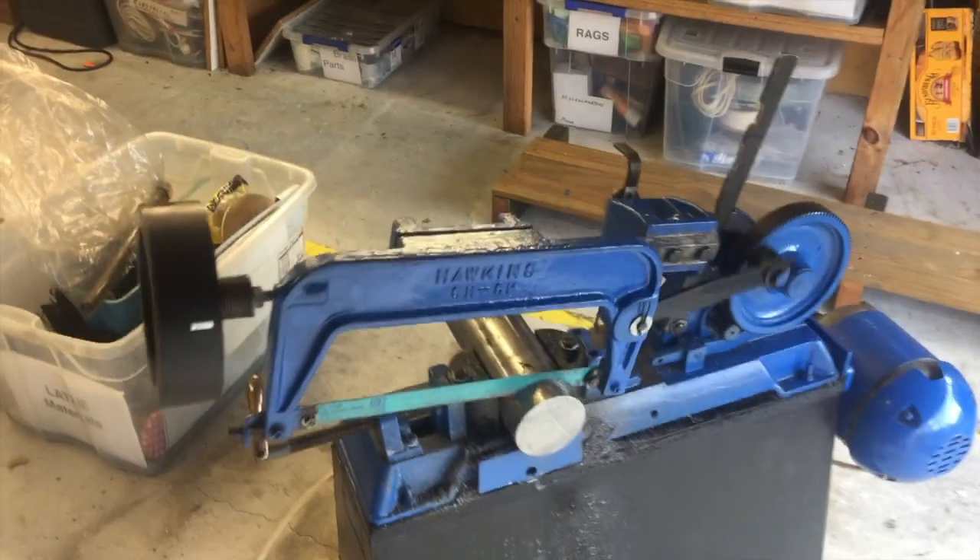This is Evan Lewis on Evan eScent, talking one last time on the thin discs. This time I've been labeling the discs using the usual standard metal punches — the square punches — with a hammer. At first I tried doing it by eye and found the letters were all coming out higglety-pigglety, up and down and sideways. So I decided I need to make a jig that would rotate the stamp around a certain amount with each letter.